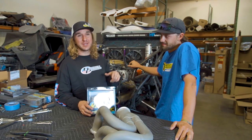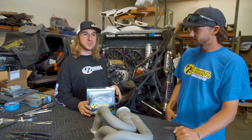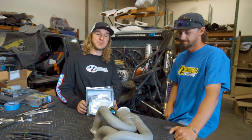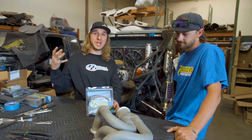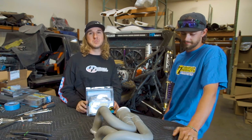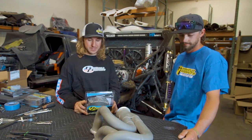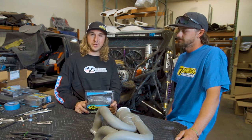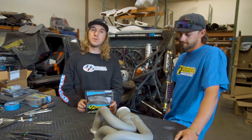This stuff is epic. It reduces your exhaust temps up to 50%. My motor here is usually in a confined space, so temperatures get pretty hot back there. This will help push the heat out of the exhaust instead of radiating it off of the exhaust, which is ideally what most people are looking for, if it's under the hood or even by vital components. This stuff is rated for 1200 degrees continuous heat exertion and 2000 degrees intermittent. So it's top notch, state of the art stuff.